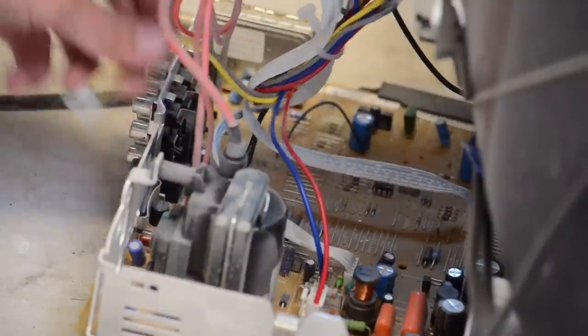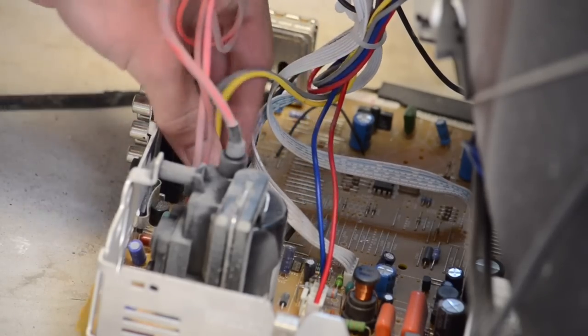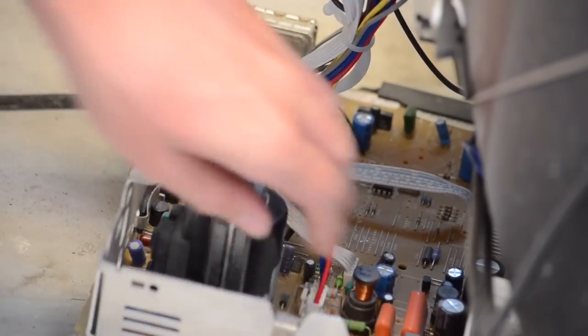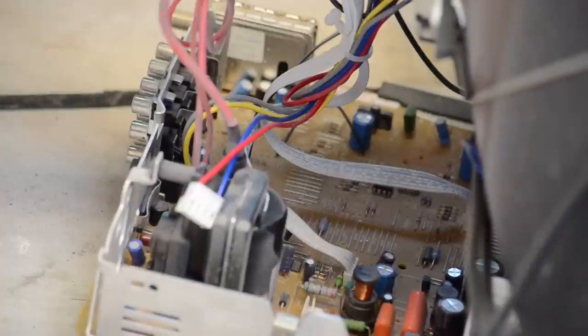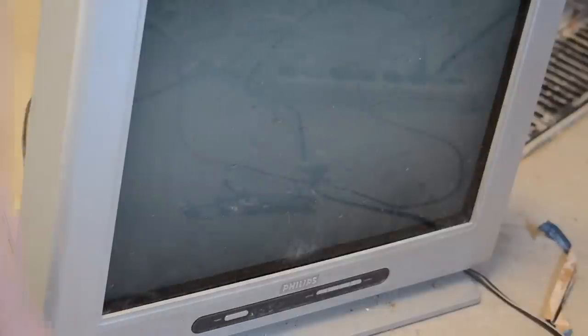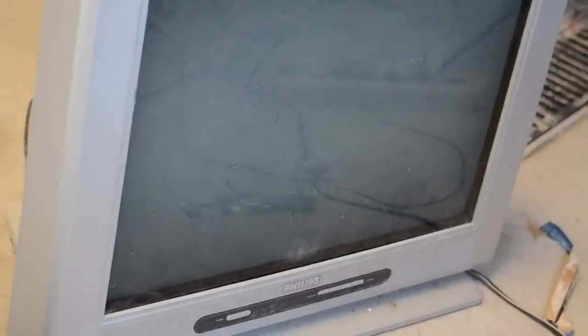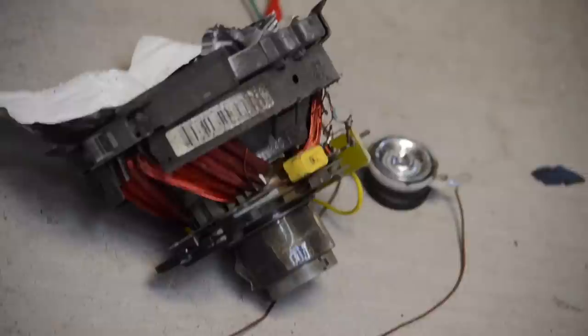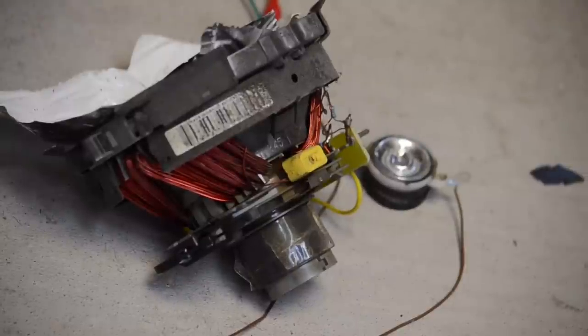Let's try the other coil. First, let's reconnect this to its primary position and disconnect the other coil — we should get a horizontal line now. As you can see, my TV isn't starting up. When the TV doesn't fire up at all trying to run the vertical coil, that means you have a special TV. These TVs are safer but will be harder to work with. I tried resistors equaling the same resistance as the coil itself but it was to no avail — the TV still wouldn't fire up.